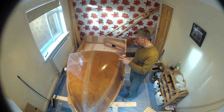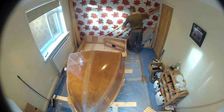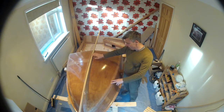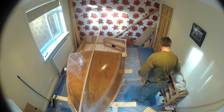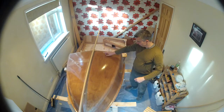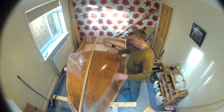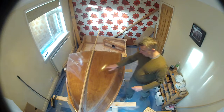Before I do that I want to get the two sections joined together and get the keel scribed. So basically this piece of wood here is the keel. What I need to do is join the two pieces together and put the keel onto the aft section, pop a piece of wood under the aft end to raise it up slightly, then draw from that height all the way along - maintaining that height to create a curve equivalent to the curve of the hull. Then I cut that curve out so this piece will sit down onto the hull.